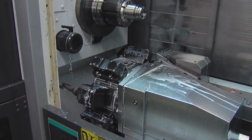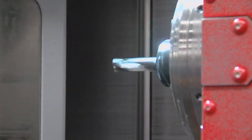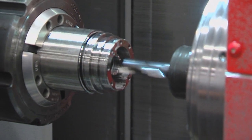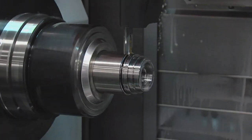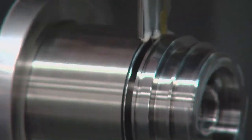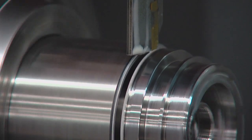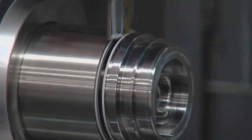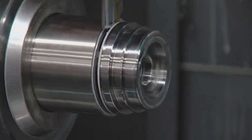It's going to go grab a drill that drills on center — it's a coolant drill. This machine has high-pressure coolant, which allows us to do this heavy drilling with no pecking. We have excellent chip removal at 2,000 PSI. What it's actually doing is pecking down in there — machining in and backing off to break the chip — so we can wrap our radii down into that feature without plunging into extra material and damaging it.